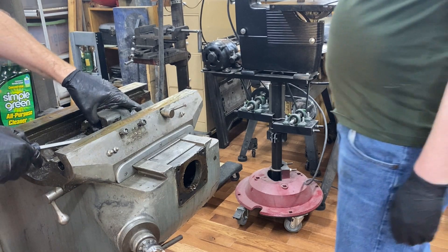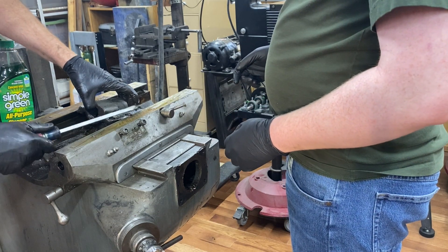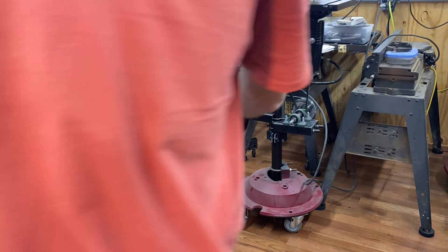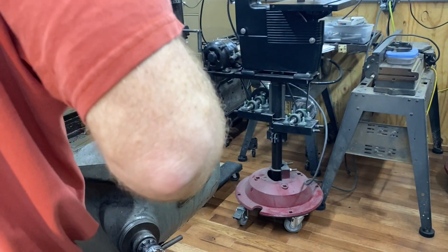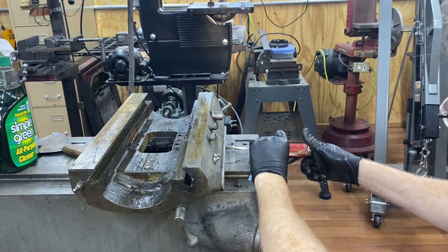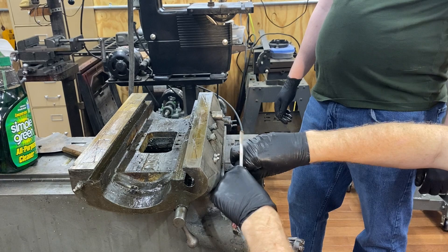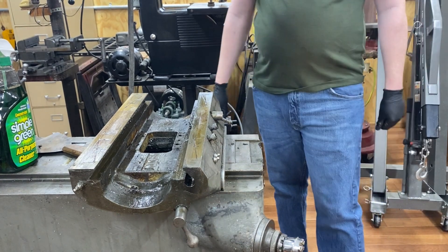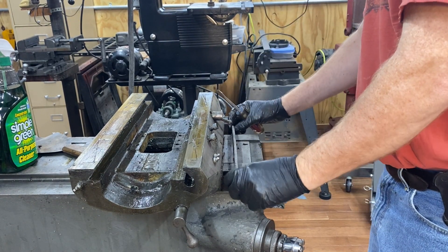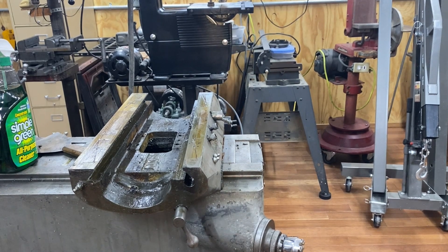It's just because of friction. If I lift them off — see, they'll lift off. And you rotate it. Isn't that nice? So now this will slide off, because when you take this off there's a gib. But as nasty as this is, this is so much amazingly nicer than when I did my other one. The other one was just all rusted. It's at Knox Makers. We had to redo it — I think I got the bearings wrong and it started vibrating and it wouldn't cut right, so he got a new spindle, and we're in the process of putting it all back together again.